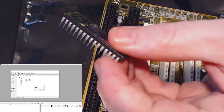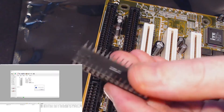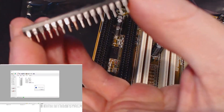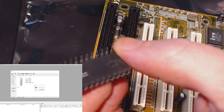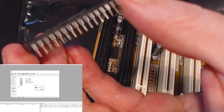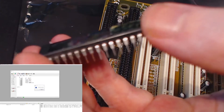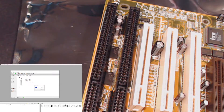I'll clean them off with some alcohol before putting the chip back in the programmer — don't want dirt in the ZIF socket. I've got the brush out. You can still see that one leg is looking very grey and you can see the coppery sheen on some legs. The leg rot on this chip is pretty bad. If it doesn't post, I know my first troubleshooting point is right here, but I still think it will post.